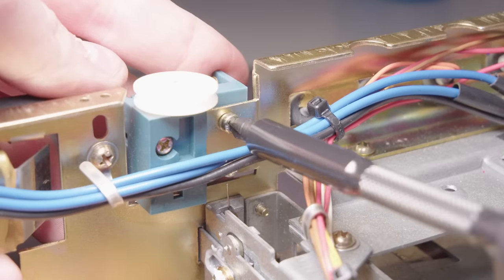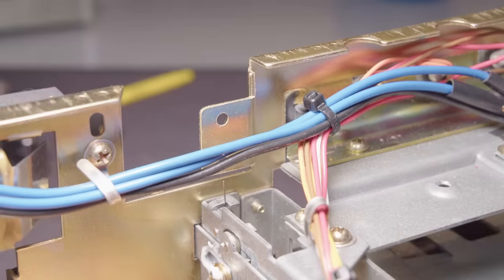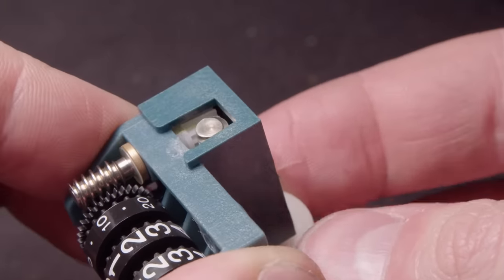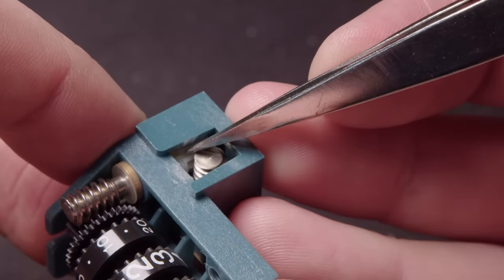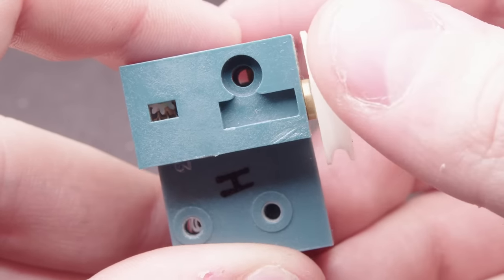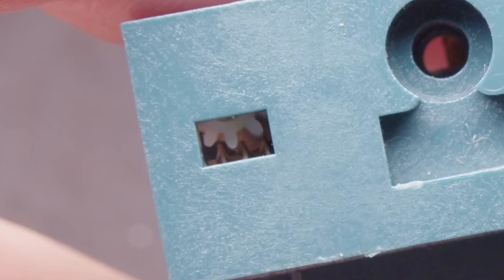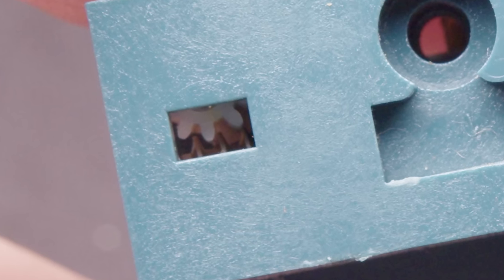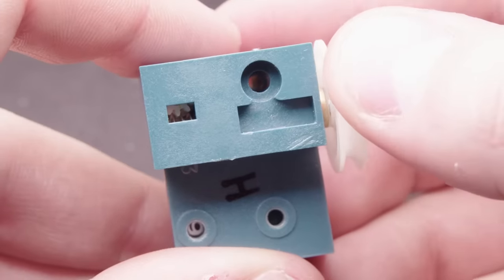You can see it says 50 on there - it's 50 seconds. Two screws on the back to remove this. Looking closely, you can see that yellow line right at the top, and to me that looks like a crack - more specifically, old glue. If I pause and zoom in, you can see on the right tooth of the gear - it's right on top of the screw - that's where it's jamming up. The gear is basically splayed open there and it's not meshing with the screw anymore, so it's jamming up. It'll do it when you reverse it as well.